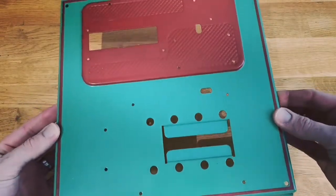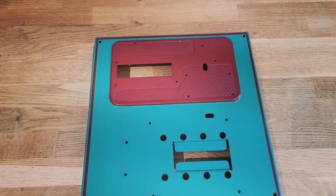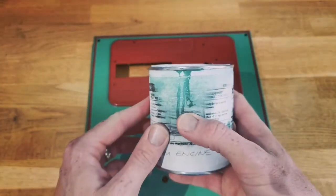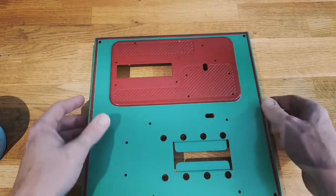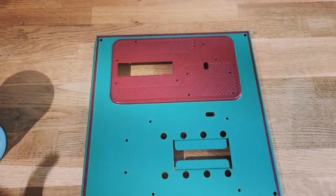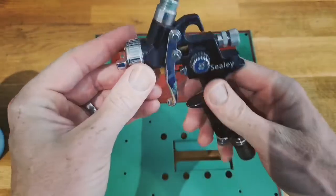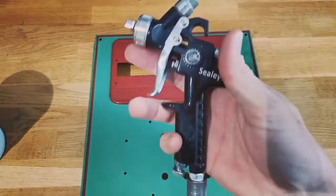I have painted the baseboard. It's been completely stripped down and I've sprayed it with enamel paint which I had mixed up. I went to my local paint shop, Colchester Panel and Paints, and had them match — pretty close — to some of the paint that was left on the base. So they matched the green for me and they matched the red too. I thinned them down a little bit and used a small touch-up paint gun with a 1.3 nozzle.